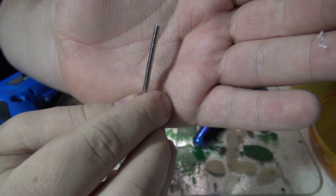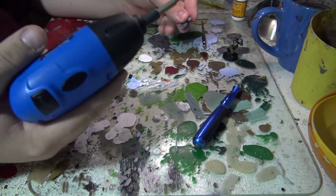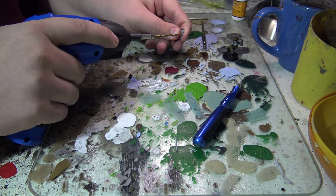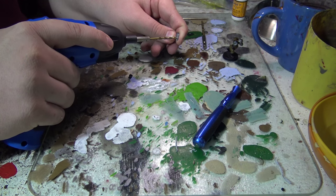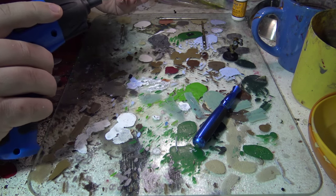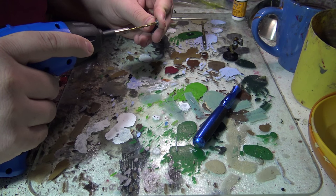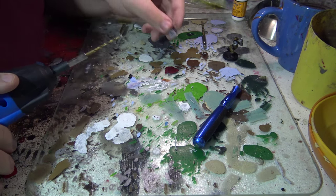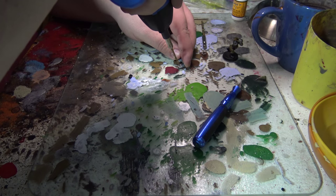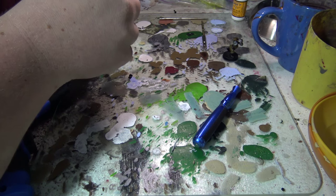It's a 1mm thick magnet, so make sure you don't drill through, and make sure you have enough depth. Don't jam the drill — go lightly. The arm is kind of circular at the back, which makes it awkward, so I'm going to place it on a hard surface and then drill. I'm being very careful not to go through the arm itself. I'll do this to both arms.